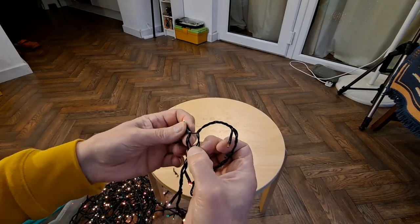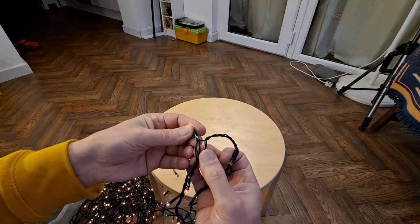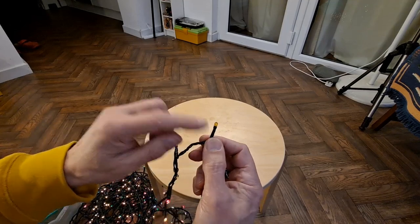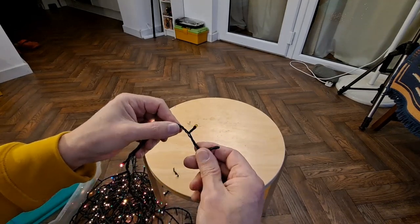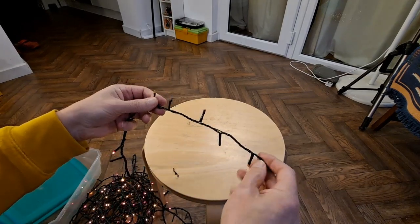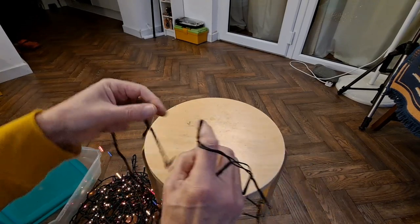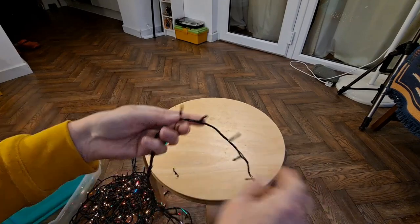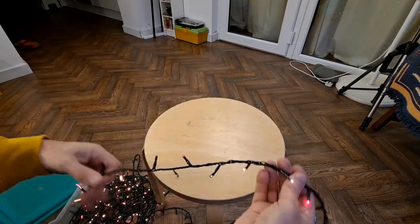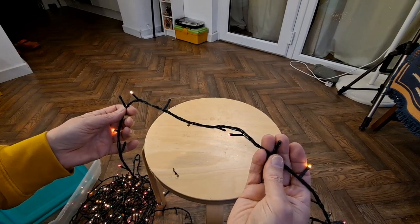And that LED there has four wires going to it. I mean, it could be as simple as the first one in that string is dead. Or it could be any one in that string is dead, because it'll have the same effect. As they're all in series, one dead one means the whole lot don't work. But that's one end of it. There was a dead bit further along. They're dead.